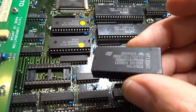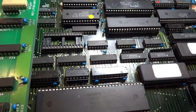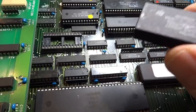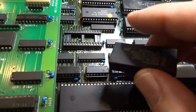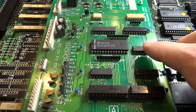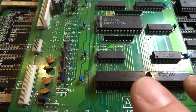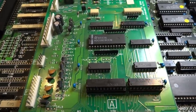One of the biggest things with the timekeeper: if this board doesn't have a timekeeper in it, it won't turn on — plain and simple. Some boards use the timekeeper to keep score or save settings, but this one uses it to boot. So if you own this board, make sure you have one that's programmed. Also, this top part here is where the guns connect, and it has two PALs that are essential — without this top board, the board won't boot.